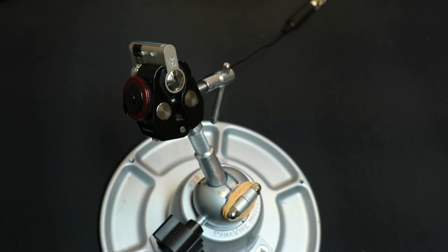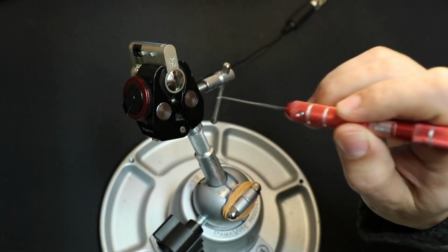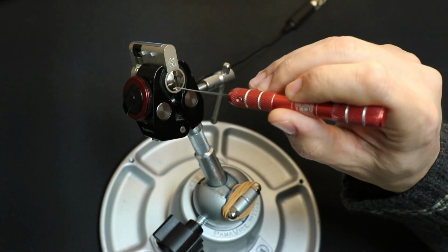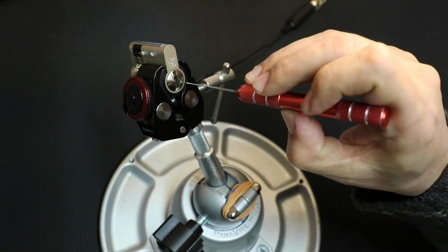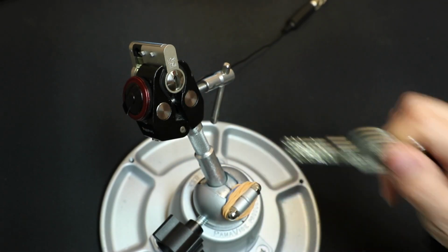Alright, today we have the Zeiss Ikon WSW. This is the exterior version of the lock. The difference versus the interior is this has 7 side pins in it, whereas the interior only has 5. The 5 would be on just one side. The exterior introduces a second sidebar with 2 pins. So it has a sidebar on the left side with 5 side pins and one on the right with 2 side pins. It also has 6 pins across the top that are fairly trivial to set.